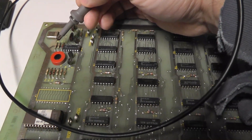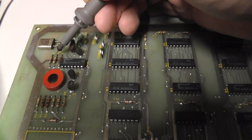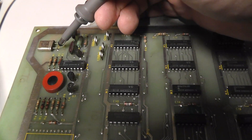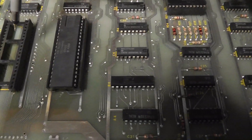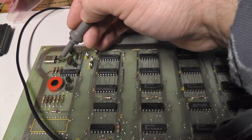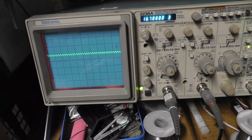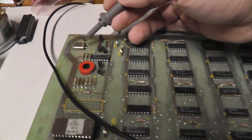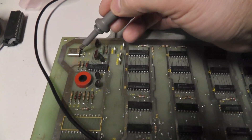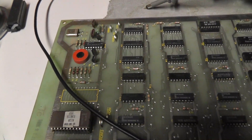Poking around more — five volts is applied to R1, and R1 and R2 are both connected to one leg of the crystal. I took out the CPU, I have five volts applied, but I'm not even triggering on anything. My 6 megahertz is really low. I think something is wrong with this crystal. I don't have new ones but I'm going to pull one off a non-working Battlezone board and see if that fixes it.